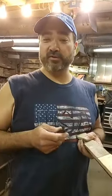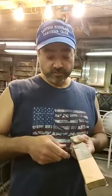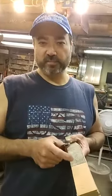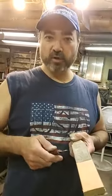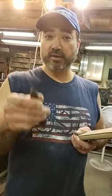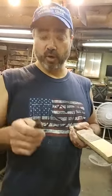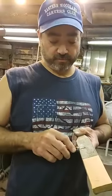And Don Mertz gave me good advice, which I was alluding to with the 80 grit. If you get that burr on a stone at 400 grit, you're going to have a hard time getting that burr off because it's a bigger burr. If you step your stone down to 2,000, and you keep working that burr till the white line will be small, you have now a 2,000 burr and the strop will knock those teeth off a lot easier.